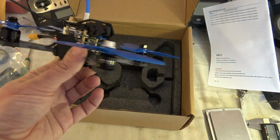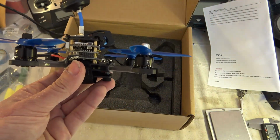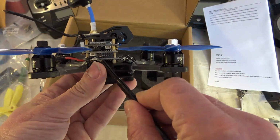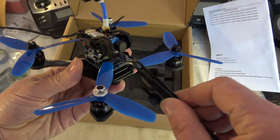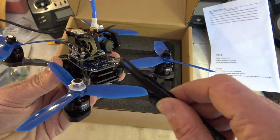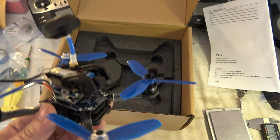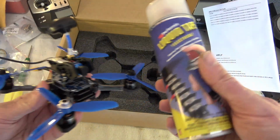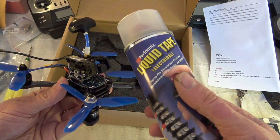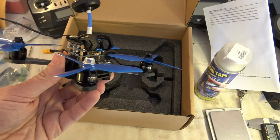Wow. So we have a tower, okay, where we have 3 layers of electronic boards, okay, the main one, but not fully protected, for example, in case of water leaks or if you crash into wet grass. So I strongly advise, as soon as possible, to spread some liquid electrical tape to protect all the ICs in case of water intrusion.